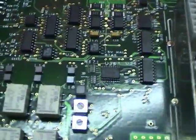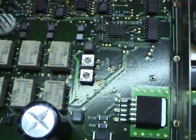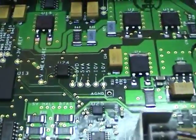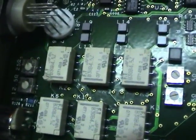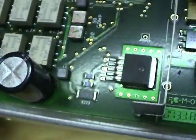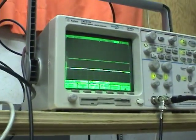It seems that this section of the circuit does indeed drive the relays, probably through some transistors or FETs under the relays as a buffer, but I'm not entirely sure that that voltage droop we saw on the 5 volts is actually a problem, because it seems to be trying to switch all the relays at once at that time. When you switch them all normally, turn it back on, see if I can get a view of one of them switching. Those seem to switch pretty normally.